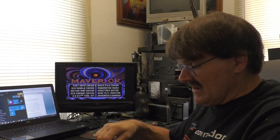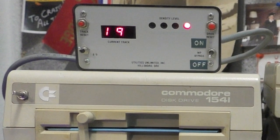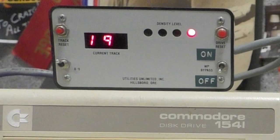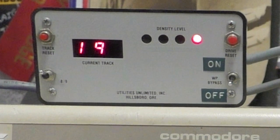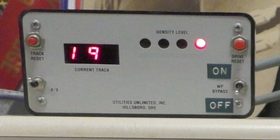Whereas the Supercard could copy literally everything, Jim needed to find a way to examine the disc as it was loading so he could develop the parameters for the Supercard. To do this, he developed a product called the Super Tracker, created by Jim Drew and Wes Weiss in April of 1989. I bought mine shortly after for about $70. This version had an LED display for the track including half track, an LED for density, along with a write-protect bypass switch, drive reset switch, and a drive 8/9 selector switch.